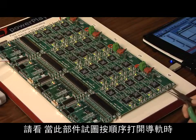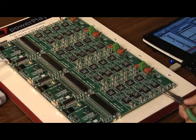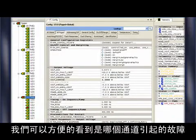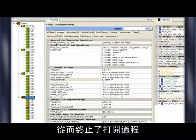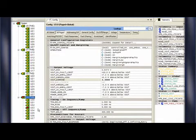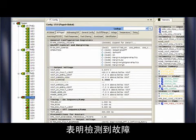In this configuration, the LTC-2978 is programmed to automatically turn the supplies back on after being brought down by a UV fault caused by these pliers. Watch as the part attempts to turn on the rails in sequence and shuts them off when the fault is detected. Looking at the chip dashboard, we can easily see which channel has caused the fault and aborted the turn-on sequence. The pliers induced a UV condition on channel 3.